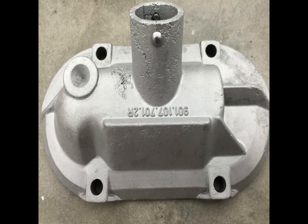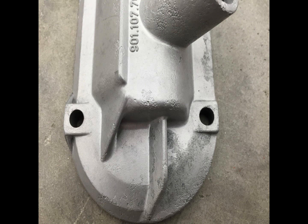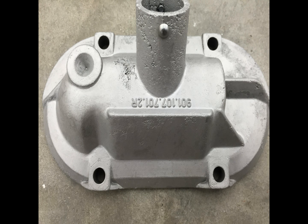You can just see the damage on the piece here and how wet blasting does help you expose that damage, so you can inspect these pieces before you reassemble or rebuild. Just the level of detail and cleanliness you can expect every time from this process.